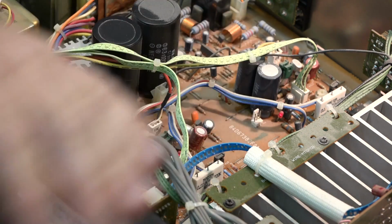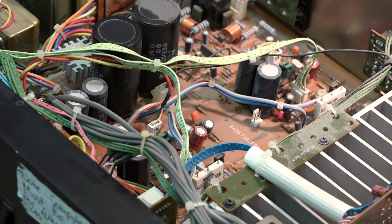It's basically in the tube circuit and tube bias circuit. If you have a tube that has, say, a filament short, cathode or grid short, and you have a voltage that's not supposed to be there, then it won't allow the outputs to kick in. It's just protection.